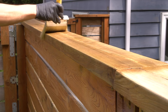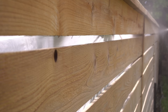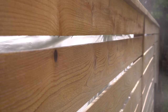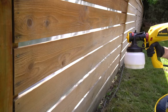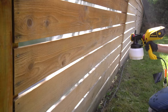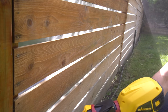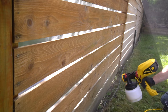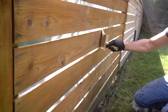The one thing to keep in mind when doing a project like this is weather — make sure you have a consistent few days at least without any precipitation. That's why we actually went with a water-based product on a fence like this. There are plenty of amazing oil-based finishes out there and I'll leave a link to one in the description box below, but you do need to make sure it's at least above 60 degrees as well as without any moisture or precipitation for 24 to 48 hours. We don't have that in the Pacific Northwest at this time of year, so we used a water base which dries in a mere couple of hours.